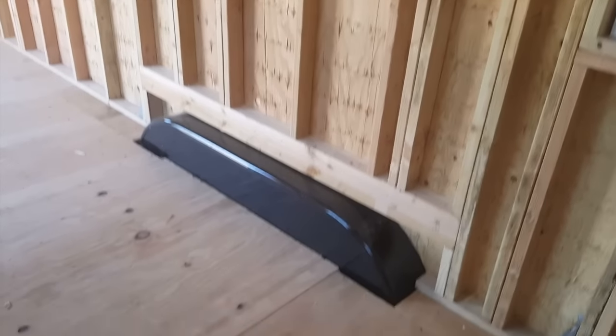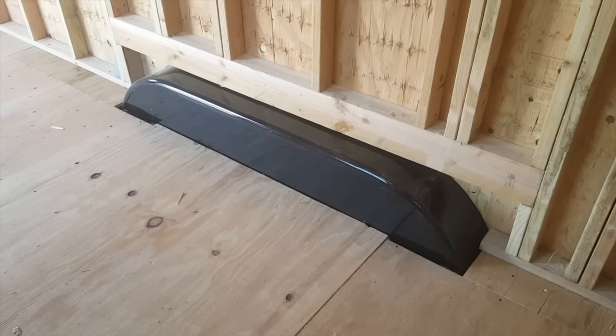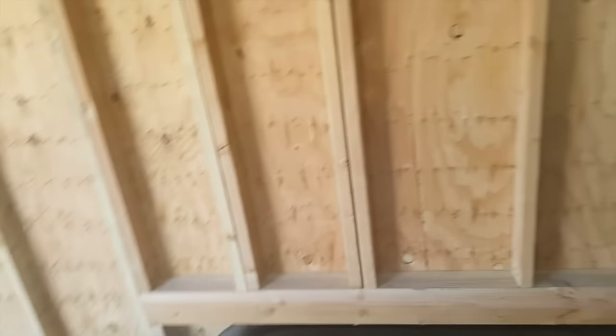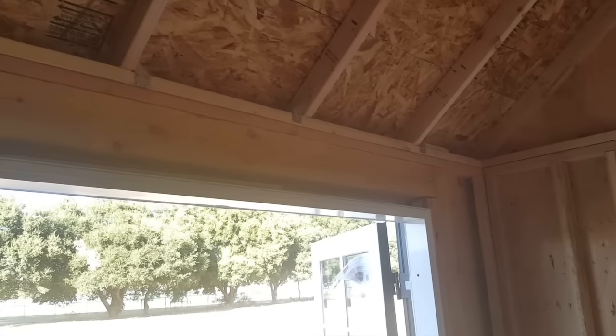With all of the fenders, they are completely enclosed with steel fenders around the wheels. We always recommend — whether you're doing a self-build or having us build — to run a header across the fender and treat it just like a window opening. That way, the load-bearing structure of the roof comes down onto the header, just like you would be framing a window. You can see that on these other windows and on the larger span across the French doors.